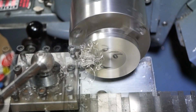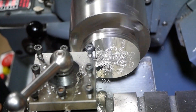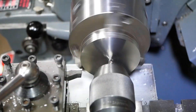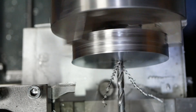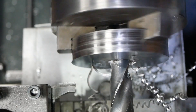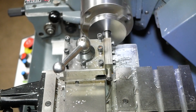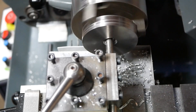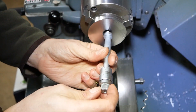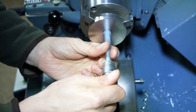As an example of the kind of thing we might use a Myford for, here we machine a component from 316 stainless steel for a prototype coffee machine. 316 is notoriously tough to machine but the lathe handles it admirably. Facing off is made easier with power cross feed and the speed of the motor can be gradually increased as the tool progresses towards the centre. This lathe is fitted with a one horsepower motor, which means drilling large holes in this material has to be done in steps, but it is still capable of drilling to just under size which can then be brought to 18mm with a boring bar.